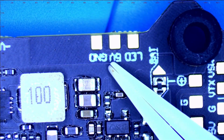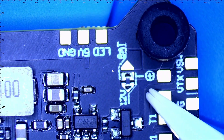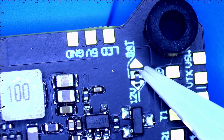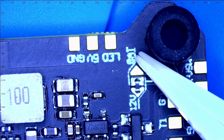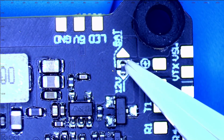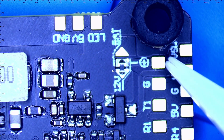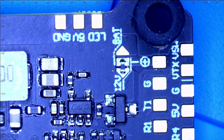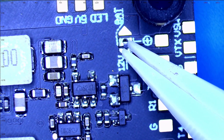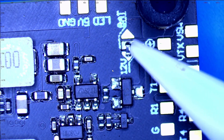Let's flip it over and see what's on the back. On the back you're seeing LED 5V ground, and you've got a jumper here between 12 volts and battery. That little component right there is bridging those two - it comes from the factory set to 12 volts. If you want full battery voltage for this plug instead, just take tweezers or a soldering iron, break this off, and throw a bead of solder from the arrow to the centerpiece - and you are now passing full battery voltage.